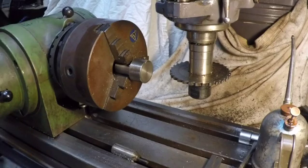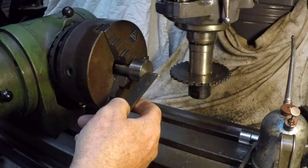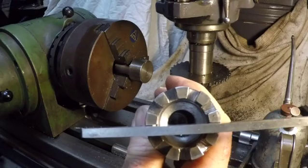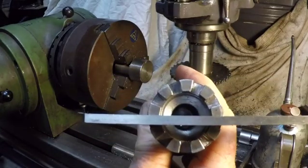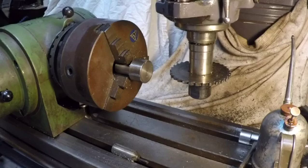I've got a 40-to-1 dividing head. I'll put the blank in there and I've set the cutter to just below so the top of the cutter is just on the center line, because we're going to be cutting below the line. That's just a straight edge put in there to show you the gaps are not centralized — and that's how we're going to be cutting it. A lot of people would say, 'How come you haven't drilled the center out yet?' — that's less milling. I prefer to have the center in there because otherwise you're going from milling to not milling and it tends to be a little bit noisy.